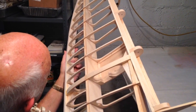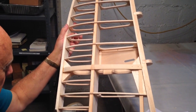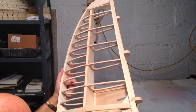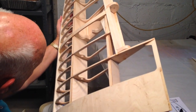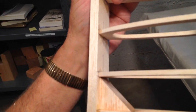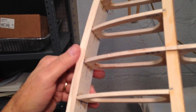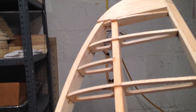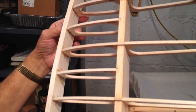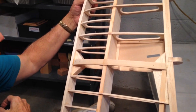We're probably going to do this in three video sections. I'm going to stop here — I've only done one side and we still have the wing tip to do. But as you can see, in just a few minutes I've gotten it down to where it's pretty close — about one eighth inch to go, which would be about 10 more swipes all the way around, picking up the angle of the rib. So we'll stop here, and I'm going to finish the taper shaping. The rounding shaping we'll do in the next video.